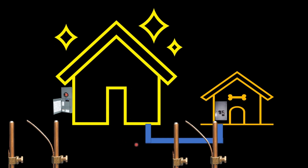The same thing is happening over here at this separate building right here. We've ran our four wires over, we've separated our grounds and neutrals, but the question is: are we at any less danger of static electricity or lightning strikes? And the answer is no, we're not. So we definitely need to establish a grounding electrode system at this separate structure to perform the same functions.